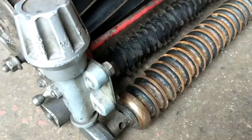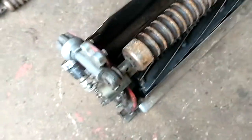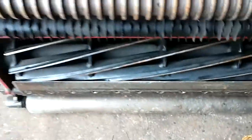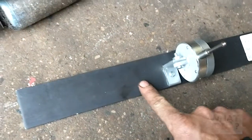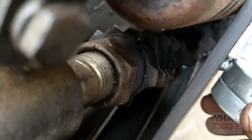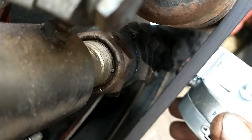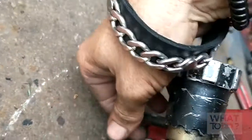There is one on each side. Now in order for this to work properly it's got to be adjusted properly — that's what we're doing here. I have this one here sitting upright. Basically what you want to do — and I pretty much got this one tuned in already — is get something that's flat and level, rest it on the bed knife and rest it on the roller. The idea is to get that groomer just level with this bar when it's dropped down. This is in the up position so we're going to go ahead and drop it down.